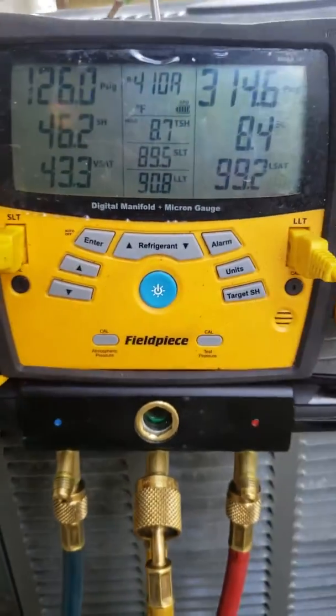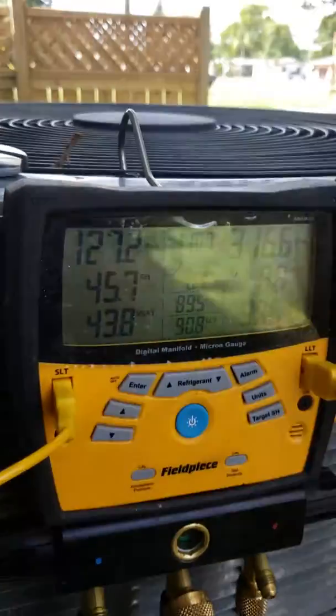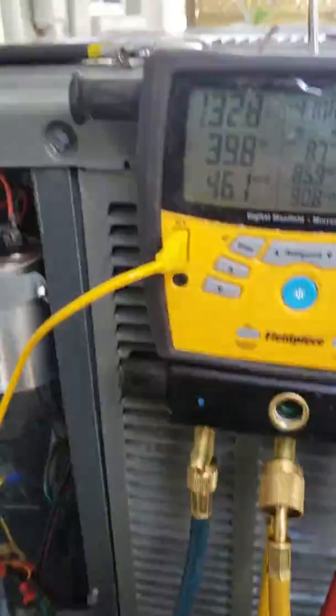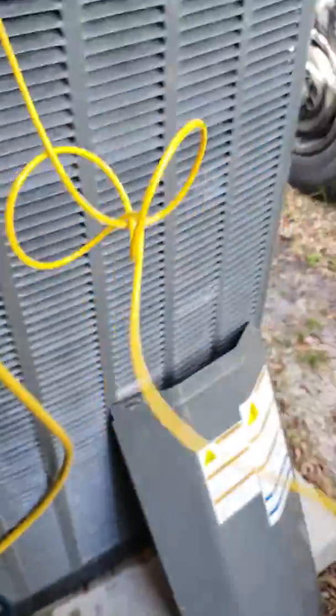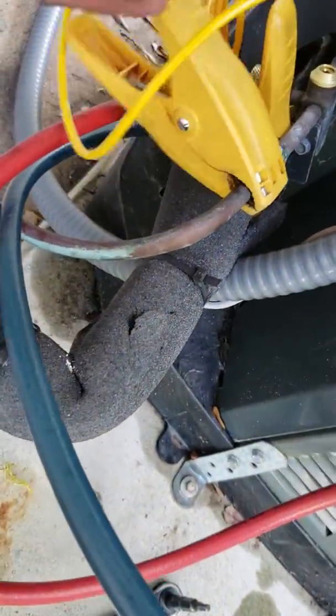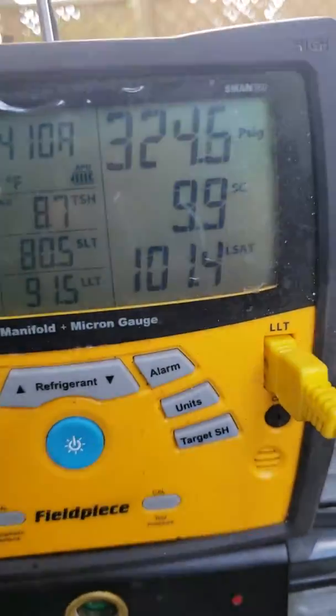Probably have to add some. From here you find your sub cooling and make sure your superheat gets down to where it needs to be. This system calls for 8 or 11 sub cooling — I don't remember but one of those two. Put the clamp on there — blue side, suction side, red side, liquid line. Liquid line right here. What's it say? 10 sub cooling, 33 now.